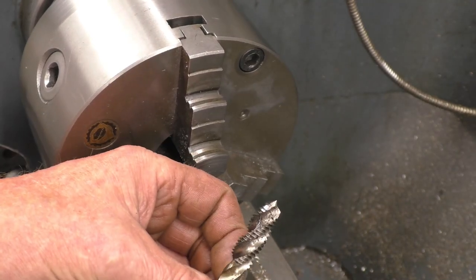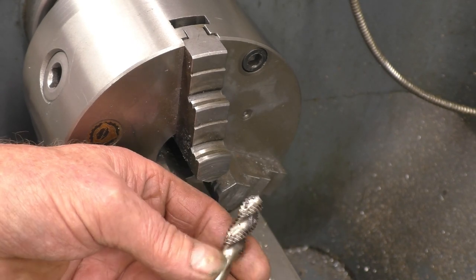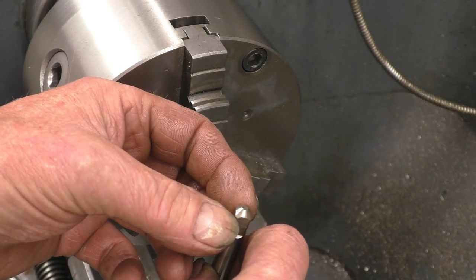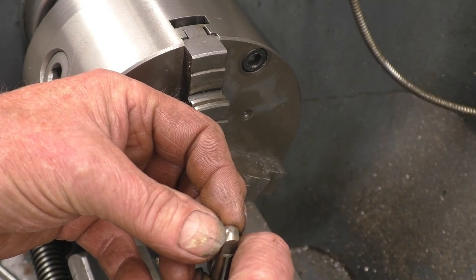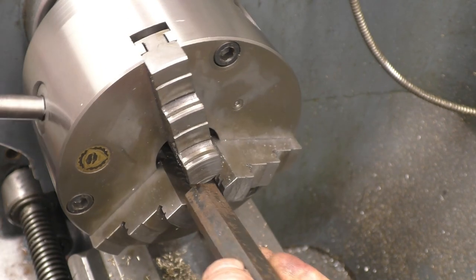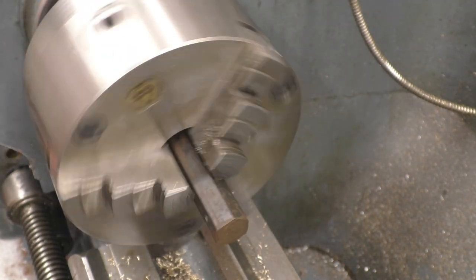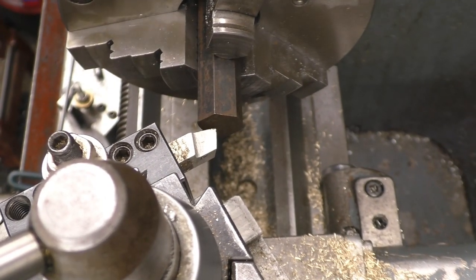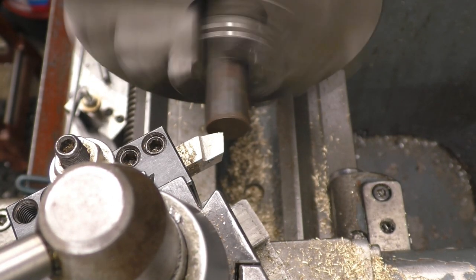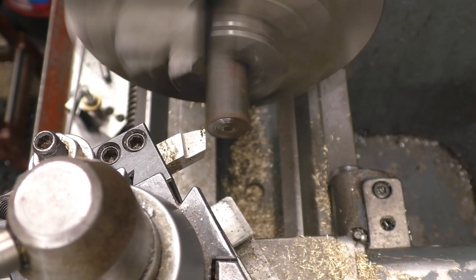This time we'll go up a little bit — that's a 12mm tap and I'll do a little bit of power tapping. Once again that's a machine tap designed to be driven in under power. It hasn't got a centre in, but it has a machined piece so you can put an external centre or a female centre on there. We've got a piece of hex steel bar here of known quality — we'll use that.